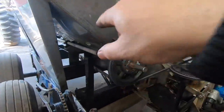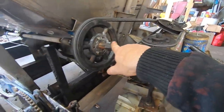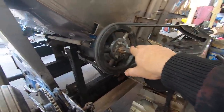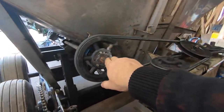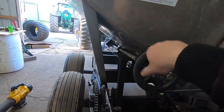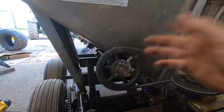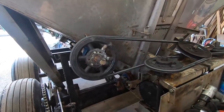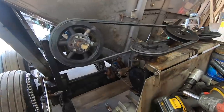The only way to really truly fix this is to buy this shaft and might just do it. Just need a universal down to the other end or I get the other universal out. Yeah. Two new pillow blocks, universal there. Pop that sucker off of there, put a brand new shaft into it. These pulleys aren't that old, but fertilizer's just a death blow to this stuff.